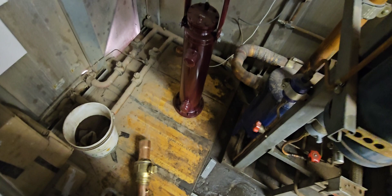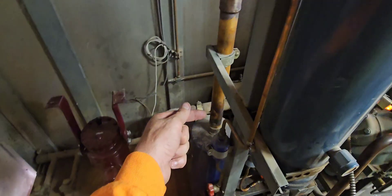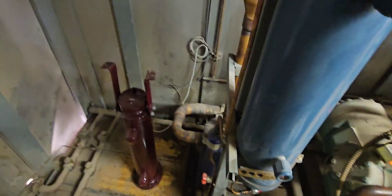I got to flip that separator over and then we'll get that ball valve out, do some 90s into the bottom of that separator, and then the top will come out and tie somewhere into the top. We're going to have this condenser line going to the condenser. So we're going to start fitting that up right here.